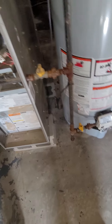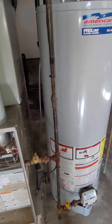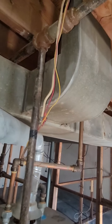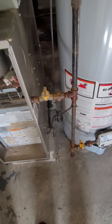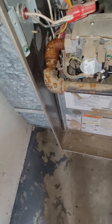The gas line — I just shut it and the water heater off a second ago. I'd replace this black pipe, probably up there if you can, and then separate and fix that with a drip leg. It's all rusted on the inside.